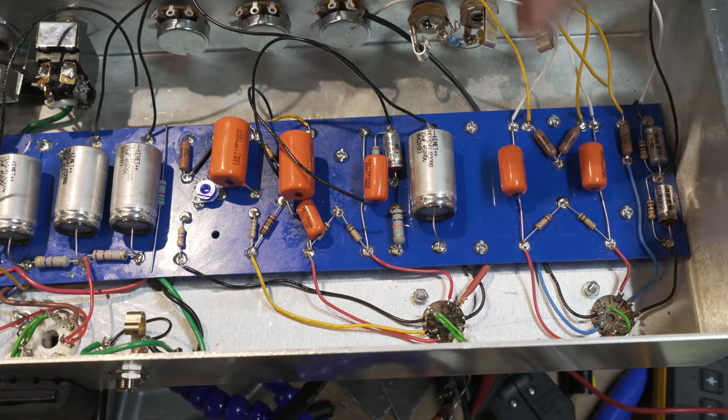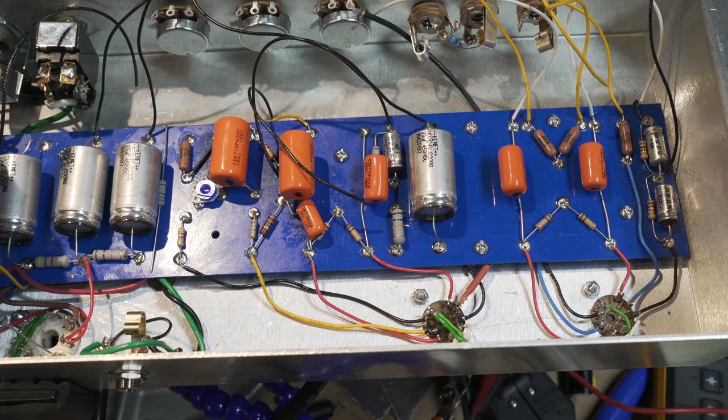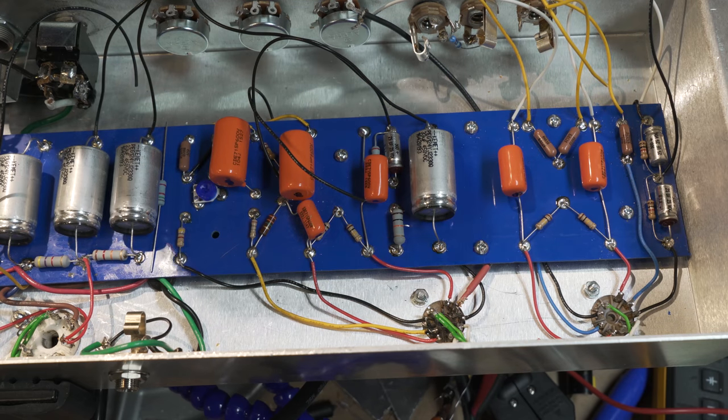All right, I'm back after a short break. I think I might have lost a little bit because I hit my max time, but I did finish this tube here, and I've come over now and started doing this one. I put the power into that one. I'm going to put it into the other half of that one, but I also need to hook these grids. They're supposed to go into pin 5, but we want a 1.5K grid stopper, but rather than having to put stuff on the board, I will just jumper them between 6 and 5, and then they will be set to go. So we're going to do that right now.